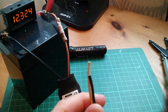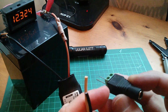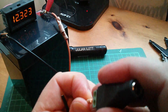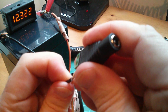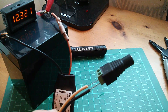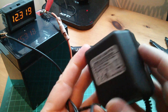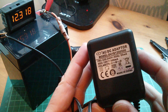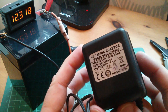On the other end I've got a similar arrangement: a couple of clothes pins pushed into one of these 2.1mm connectors. I'll push the positive into the yellow side — careful not to stab myself — and then I plug in a power supply. This is a linear power supply with a transformer; it's quite heavy, nominally 12 volts half an amp, but you get about 16 or 17 volts offload.